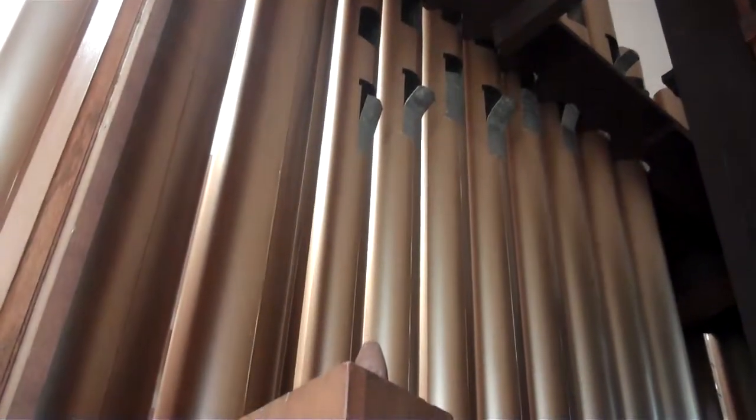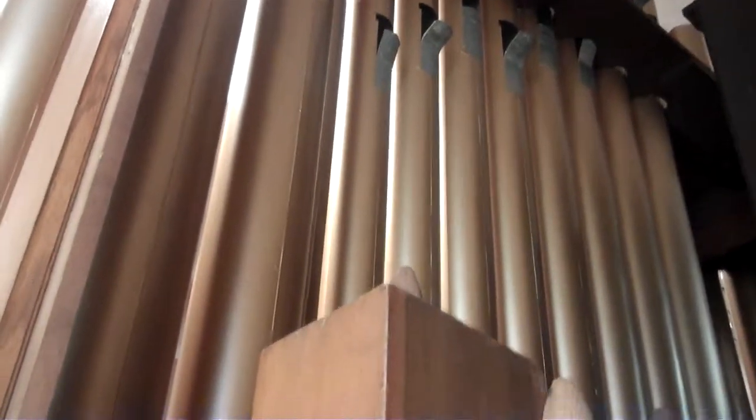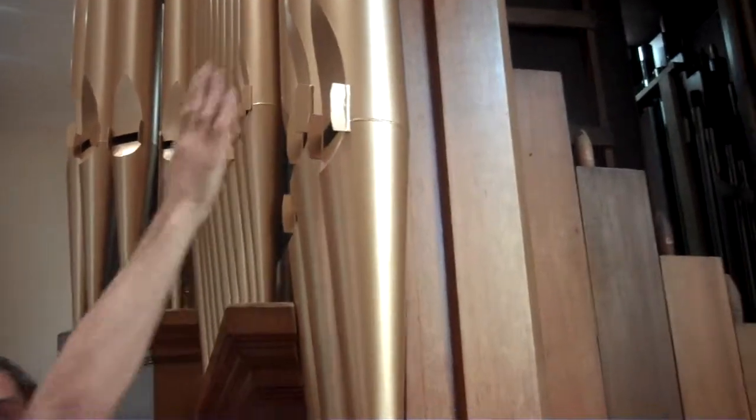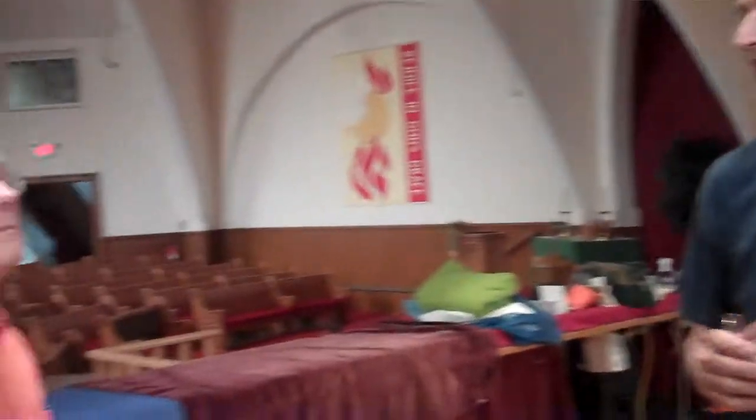The voicing — what we were doing is when they had it on the painting, they moved the pipes and things. When tolerances change — tolerances such as the lower lip or the upper lip gets moved in or out because of handling — it's fractions. Inside there is a flat piece of metal called the languid that's soldered in the joint across. When the wind sheet comes through the foot, it's going to split by that opening — the air is going to hit here, and the other half is going to go inside the pipe. So with voicing, you have to find that fine regulation.